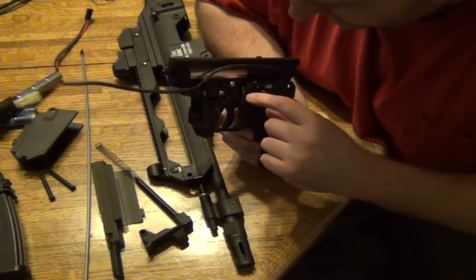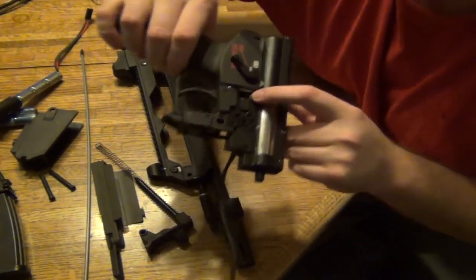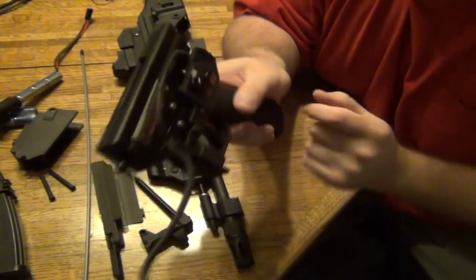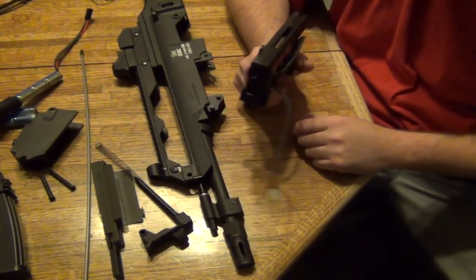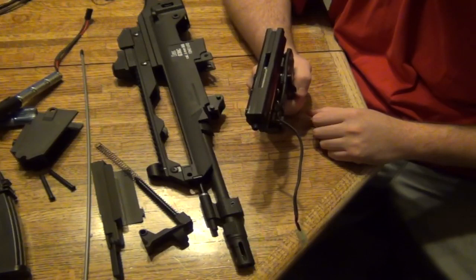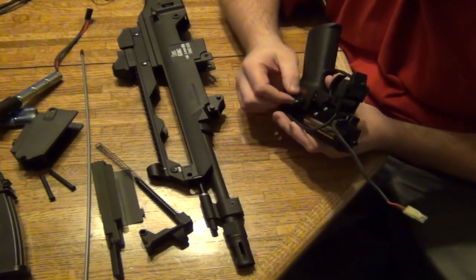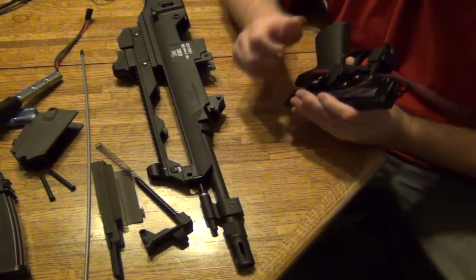You need to look for spring-loaded parts. There's going to be gears down here, and here's an example of a spring load — there's a little spring right there. There'll be one down inside on this side too. You don't want to lose those. If you do, what happens is you flip your selector switch and it doesn't stay in place — you move the gun and it goes back up because there's no spring to lock it in place.